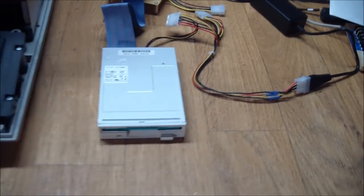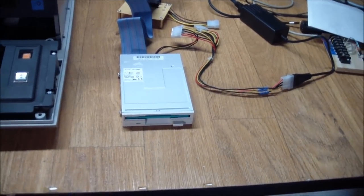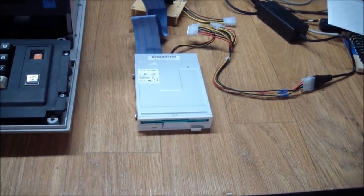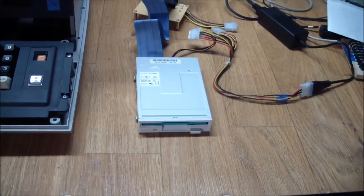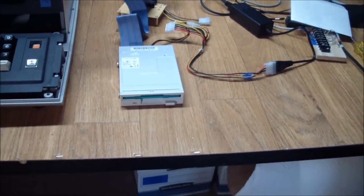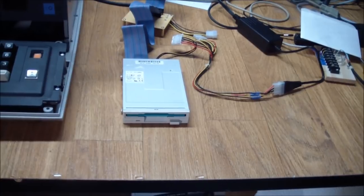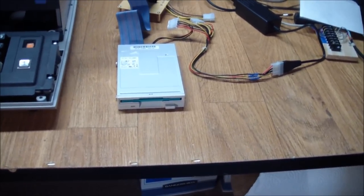We're still dealing with old magnetic media, but let me tell you, I have seen far fewer floppy disk failures with 3.5-inch magnetic media than the 5.25-inch. And I mean far, far fewer. So I'm sure the composition of the material used, especially on high-density disks, is of a much better quality than it was on 5.25-inch drives. And so this is one option that we could consider.